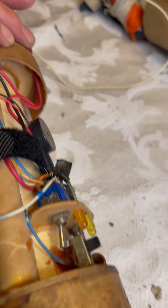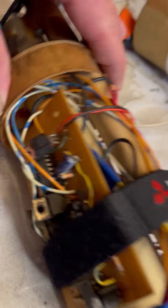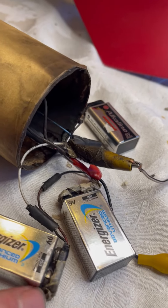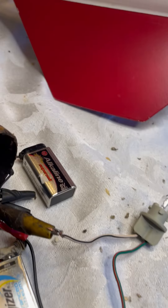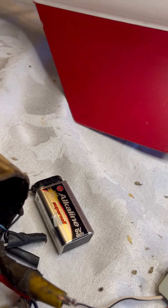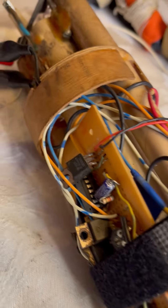So I came back with this engineering tour de force. This thing does continuity checks on three timer events built into this board. It runs on two separate power supplies: one set of two 9-volts to make 18-volts to trigger the ejection charges or the igniters for motors, and the whole thing runs on a 9-volt which is actually regulated down to 5-volts to give an absolutely solid voltage.